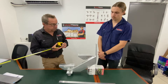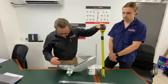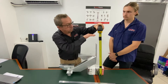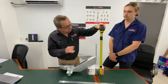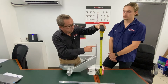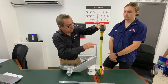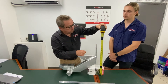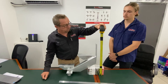The other part we want to talk about is the total rise. The example we've got here is a two-step configuration — one, two — and then the third one is up to the landing. I've got the marker set at 525mm here, and that is the height that would be on top of your veranda or deck. The mounting point is just below that, giving you room to secure to the bearer and joist. So the height is 525mm, with each step at 175mm, bringing you up to the deck at 525mm.